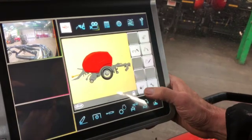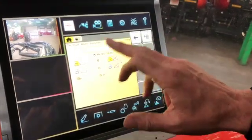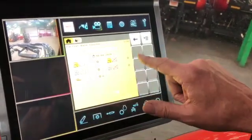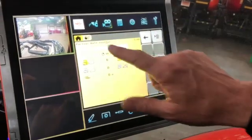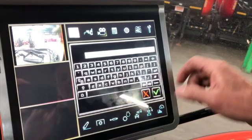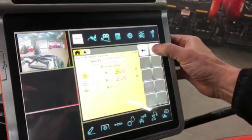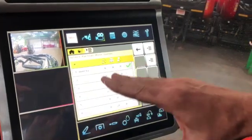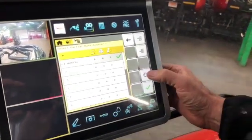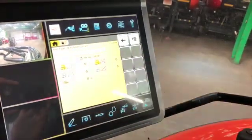First off, lock the box. Then press the icon here — that takes you straight into the bale counts. We can store 40 fields' worth of information and name the fields. Press the tick button and it appears. If you want to clear the bale count, press that to bring up the 40 fields, then hit the clear button and confirm with the tick — as you can see, it clears the bale count.